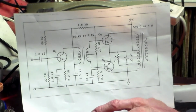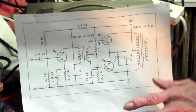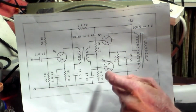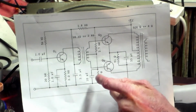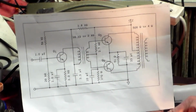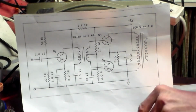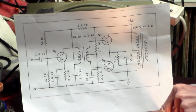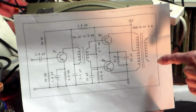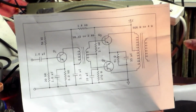Also with this, if you've not got the details on alignment, just set it up like I've done, and do the IFs first, and then of course, as far as the RFs go, if the tuner has screws or adjustments on it, leave those alone if you can, but the other ones nearby you can check. And also remember, as far as the coloured trimmers go inside, red is oscillator, and the other colours are IF, which you do align first, and always keep the signal generator as low as you can.